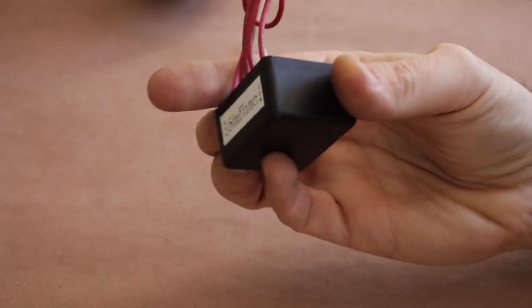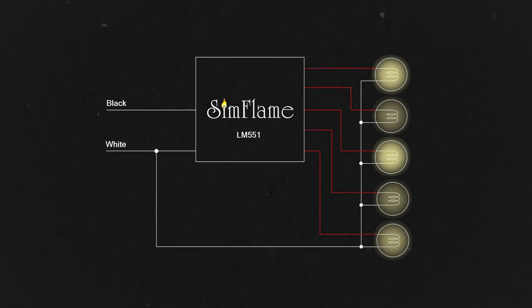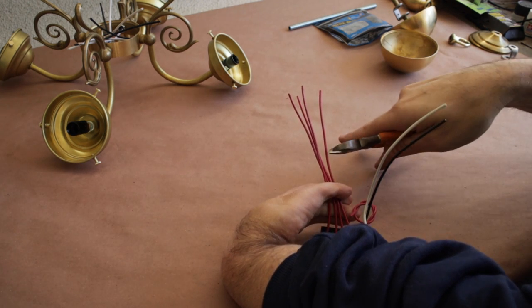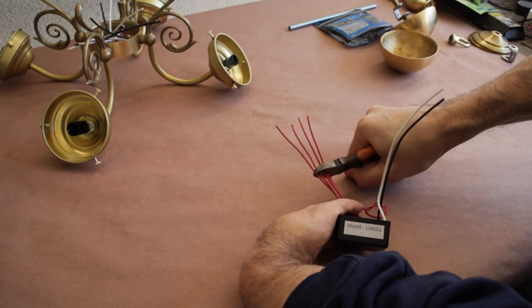Since we're talking about the Simflame, let's have a look at how it's wired up, since I managed not to film that part. For the model I'm using, you have five wires that control up to five lights. You connect the red wires from the Simflame module with the black wires on your lamp sockets, and then all of your white wires connect to the white wire on the module, and then connect the white and black wires from the module to your power source. Since these cords were a bit too long, I decided to trim them down before stripping them and connecting them to thinner gauge wire that would more easily fit through the threaded rod and into the body of the lamp, where they'll be connected to each of the four lamp sockets as well as the main power.